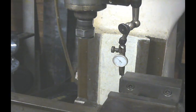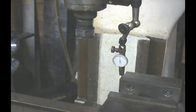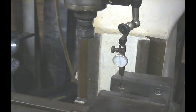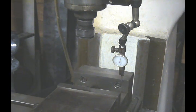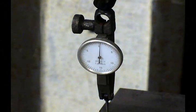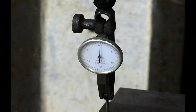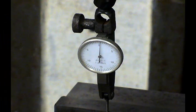We know we're going to have to bring this side of the vise jaw towards us. At this point we've actually lost contact, so we come back and give ourselves a little bit of indication. The problem with these little indicators is there's not a lot of travel, so it takes a little bit longer. Now we're going to see this start to go a little high — we're actually two thousandths away. This is the high side, so we can tap it, very similar to splitting the difference. By using a series of very gentle, very light back-and-forth taps, you're going to get to the point where your jaw is absolutely dead nuts.